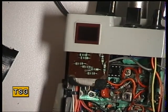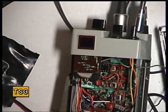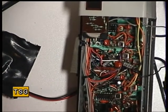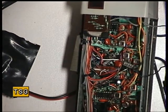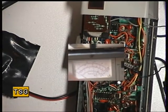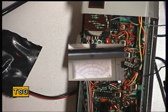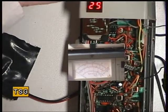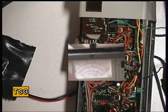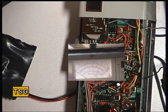We'll move the radio along to see what we're doing. I'm going into transmit and we'll just switch the test set to make sure that's on frequency. It should be 27.79125 MHz for channel 20, which is in the centre of the band of course. And would you believe it's showing 27.79125 — that's not bad for its last service from 16 years ago.